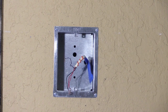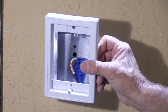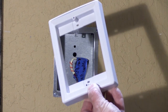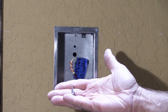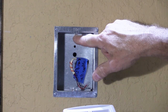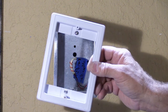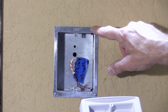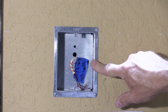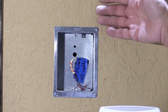Let me show you how to put this together. To make it clearer on video, we'll start with the white one since it shows up the best, and then at the end we'll do the antique brass with the bronze update frame. Your update frame comes with two small mounting screws that fit through the holes and screw into the mounting tabs on the rough-in. These screws are about an inch long and work perfectly if the rough-in flange is up against the face of the stucco wall.